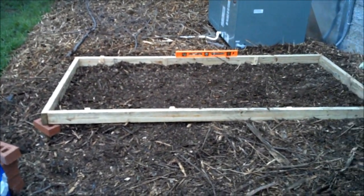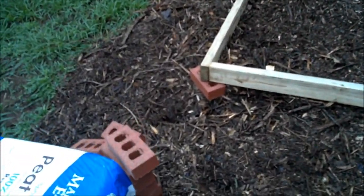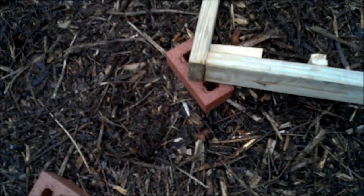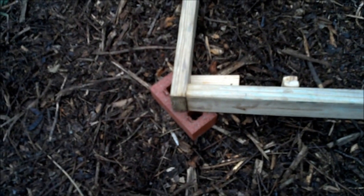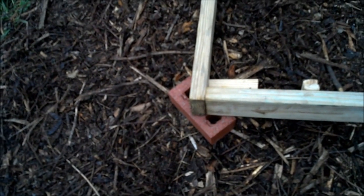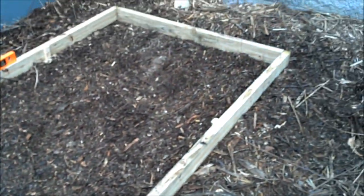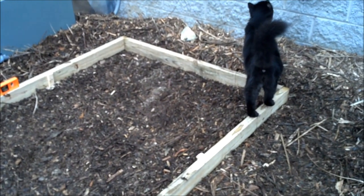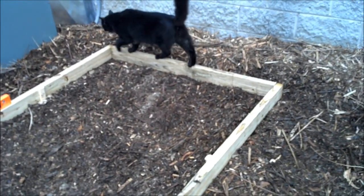Level out the site. I added a brick down here because I was having trouble with compaction. As you can see, I don't have a ton of extra chips on this corner, so the brick will actually space it out and keep it from compacting too much. This will spread the weight out at the corner and provides a more stable surface sitting on top of the chips. There's probably about eight inches of wood chips on this end — this end being higher up terrain-wise — and it's only got maybe a half inch or an inch of wood chips on the other side, then you get to cardboard and earth, so that one's probably the more stable of the sides.